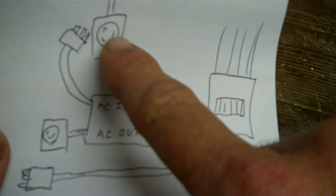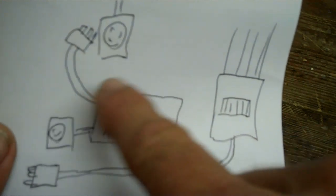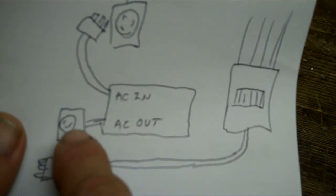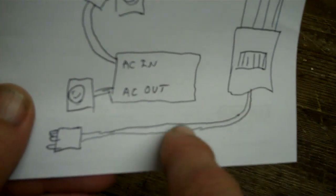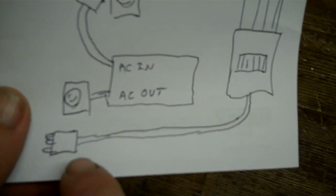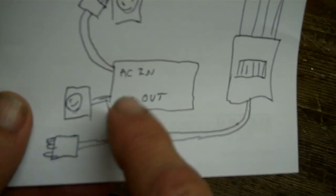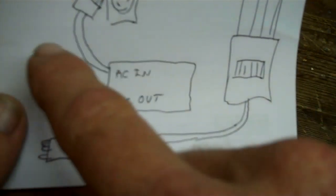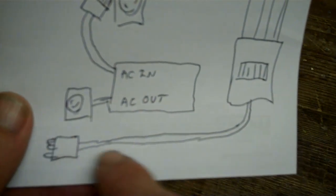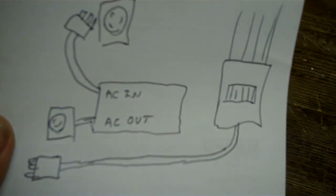You've got your grid, comes to a 30 amp twist lock plug — which is all the inverter can do anyway — goes through the inverter, comes out of the inverter, twist lock plug. You've got your twist lock that comes out of your panel — this can come directly out of your panel, it's legal, especially with that cable. And if you were to have a problem with the inverter, instead of having to double throw a switch, you just unplug the inverter, take your wire coming from your panel, plug it into the grid — it'd be doing the same thing.